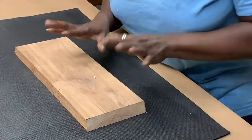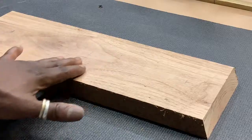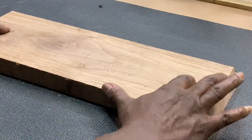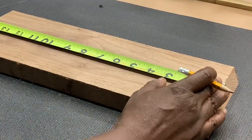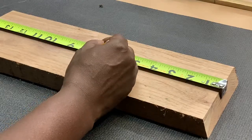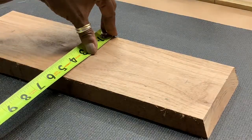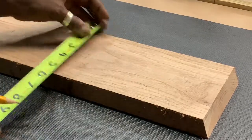Number 2. Remember the other half of that long board? Since this is going to be the second gift we're making, what we need to do is make a center hole and 2 holes on the end here. And I've done a little bit of measuring, but for the camera's sake, this is 14.5 inches long, and so half of that would be 7 1/4 inches, and I made a mark here, and then I measured here. It's 5.5 inches long, and so that would give me 2 3/4 inches, and I made another mark, and that is how I came up with my center point.